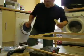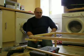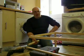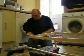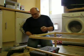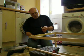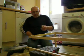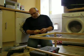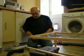Today we're building a frame for cushioned seating in a camper van. I've seen this done in caravans and they use really thin wood — scary thin actually, probably sections of 25mm by 15mm. Very, very light. You would think it would deflect and bend, but using plywood sandwiched together with it makes it incredibly strong but very light, which is just what you want.